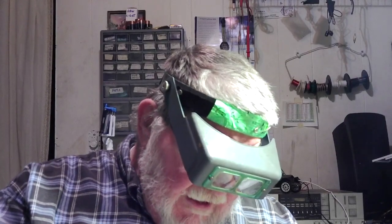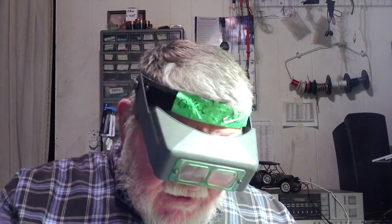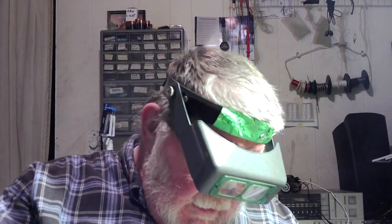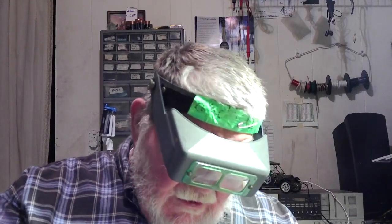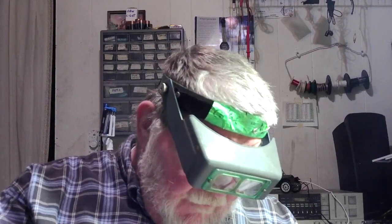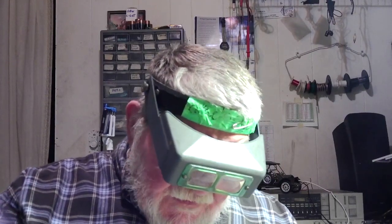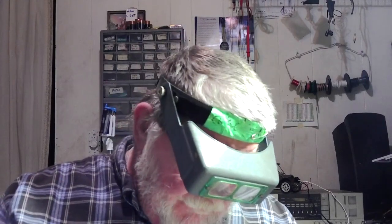Grid number 3 in the internal shield says that's connected to the cathode, and that's going to be the suppressor grid, and we're going to look at that in a second when we go to the whiteboard. Same way with grid number 2, supply voltage will be 100 volts. The cathode bias resistor, 68 ohms. And you'll see on the schematic, that's exactly what the schematic calls for, which is pretty cool.